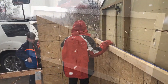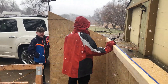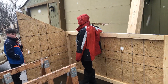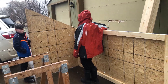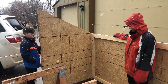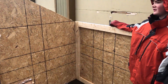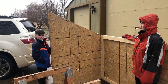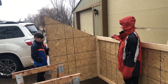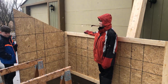I got some of the other boys out here helping me. As you can see, this is that weather we were talking about. Where we're at now is we've just cut our first wall and we're evaluating if we like the angle. It's kind of extreme — I may cut it down. The plan is that in the back you can't stand, but walking toward the front you definitely could. I want to be able to get my head under there and rake it out without ducking. It's a pretty good pitch and it's going to keep water from sitting and causing the wood to rot.